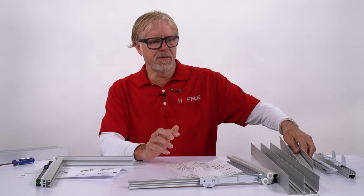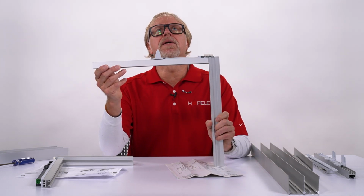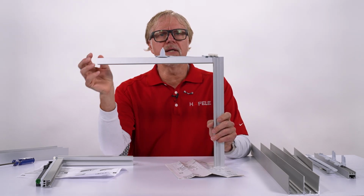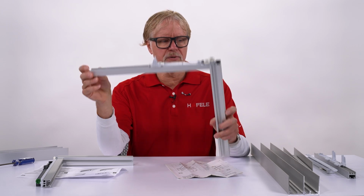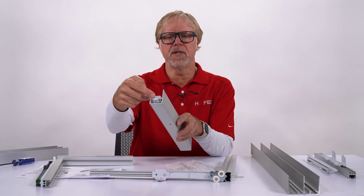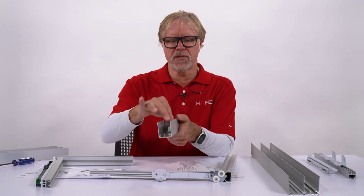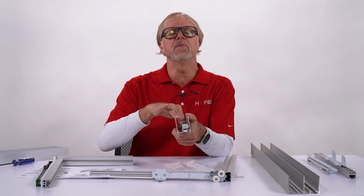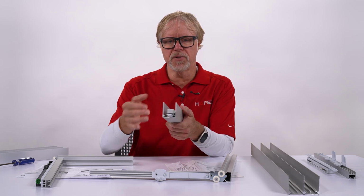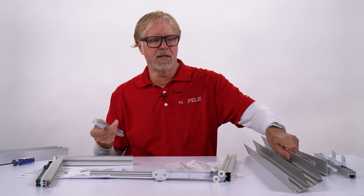And the trigger is mounted to the top of the door like this. So no longer do you move this to try and get the door to stop in a particular place. Now the adjustment you make is by loosening this screw and this screw and sliding that soft closer where it needs to be to stop the door in its location. So I'm going to pull it out of the single, kind of show you how easy it is to install into the double.